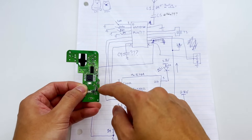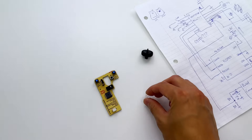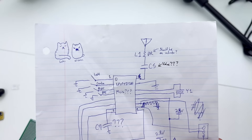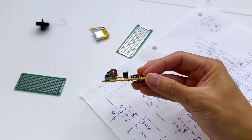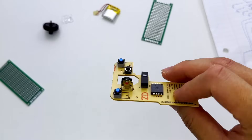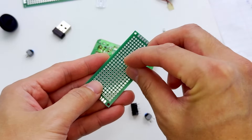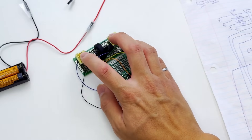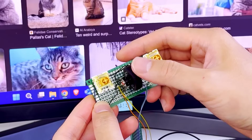The last step for the reverse engineering project is to verify and confirm the schematic. We can do that by building a whole new wireless mouse, reusing the components and reconnecting them on protoboards, using our schematic to guide us. The first step is to take all the components off the original PCB for prototyping — using video magic to desolder them and attach them to our protoboards for testing. With the assembly complete, we now have our wireless mouse prototype. This prototype isn't the prettiest in the world, but at least it works.